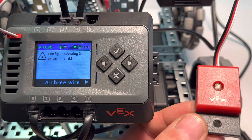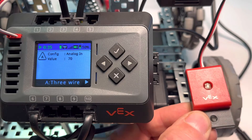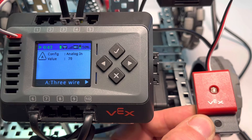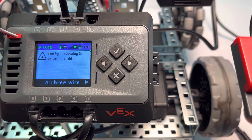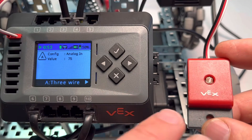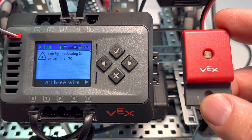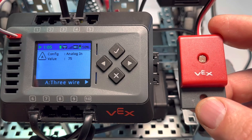It's a simple photoresistor, but it's useful in many different situations, especially as a non-contact switch or something like that in your code. Usually you'd be getting these values into code and then making some decision, but it is also nice to see as you design — especially when you're positioning these. You'd usually have a light source shining onto it so that you're not requiring ambient light for your code. It's really useful to be able to see the value as you're designing your system, and that's where reading it off the brain comes in.